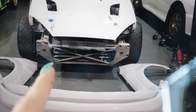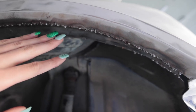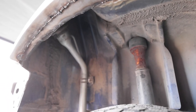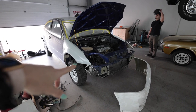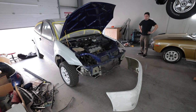As far as Angel's rear wheel arches go, he did a really good job filling this area in all the way back down to here. There's a tiny little gap left right there but this is all gonna get kind of skimmed over with seam sealer and then rubber undercoated. Now the other issue we're gonna run into is behind this is my old fuel filler which no longer goes to anything because the door conflicted with the wide body — that's a whole nother engineering challenge ahead. In the next video Angel and I are gonna try to figure out this front crash bar structure and engineer and fabricate it.